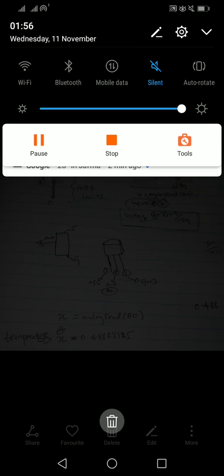There is a way to connect the sensor and read its analog values and convert them to readable temperature values, because analog values come somewhere between 0 to 1023 units. So we have to convert them to temperature values again. The temperature value will be converted into voltage by the sensor, and Arduino will take it as 0 to 1023 analog values. So we have to convert it into a voltage value and temperature value, or directly to a temperature value.